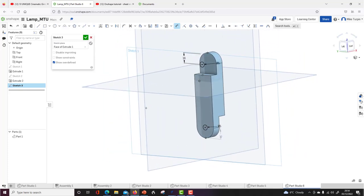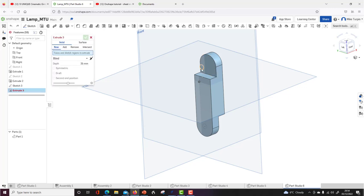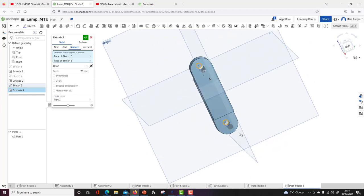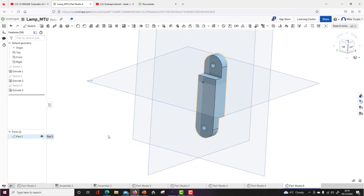Let's view that in 3D. I chose the face of the object to do that circle sketch. Now I'll extrude it — select that profile, not the others — and choose Remove. The orange shape intelligently suggests going through those parts. I can go all the way through. Green tick. I've now got a finished part. Let's be organized and rename it — I'll call it 'Long Arm'.